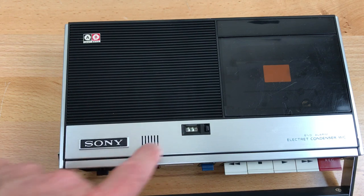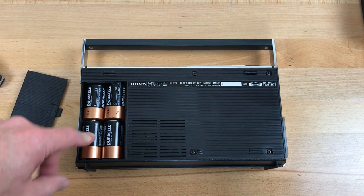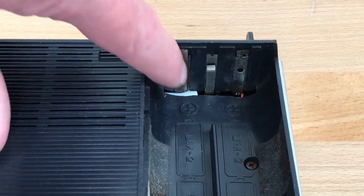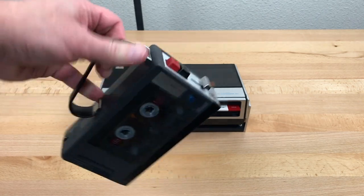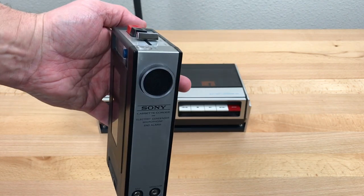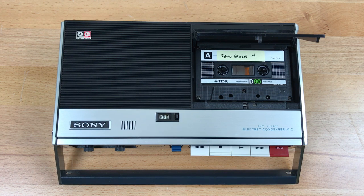There's a resettable tape counter and a built-in condenser mic. On the bottom there's a battery compartment that takes four C-sized batteries. This one had some pretty major corrosion damage to the positive side of these terminals — I had to get the Dremel out with a wire wheel and grind those down. Next on the bench, I'll be working on this Sony TC-40 recorder — it's a one-handed mono dictation recorder, and I've got new belts on order. That's it for now. I'll leave you with some shots of the TC-120 playing Anders Enger Jensen's Retro Grooves 4, mixed with the rain outside. Thanks for watching.